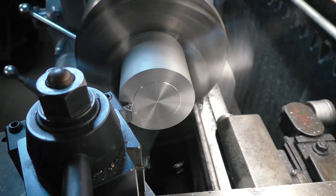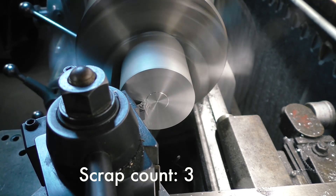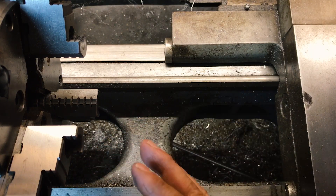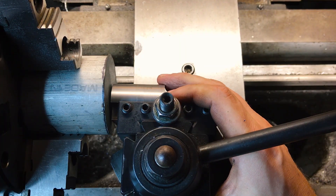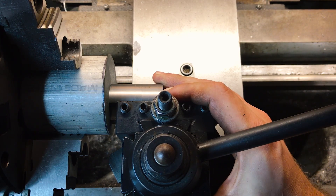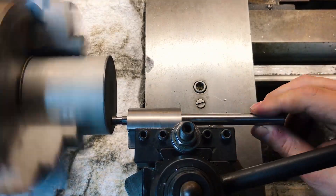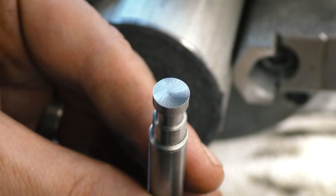I'm taking another piece of scrap cut off aluminum and facing it on the ends. I'm using some spray adhesive to put fine emery cloth on one side and 1000 grit sandpaper on the other, and then back in the chuck it goes. I can then take the little tool post mounted tool we made earlier and get it perfectly aligned with the makeshift disc sander. I probably should have mentioned I don't have a disc sander — that's why I did this. If you or someone you love has a disc or belt sander, I'd probably use that. Now I can use my screw on a stick to run the cross slide back and forth while it's turning to get a nicely, really squarely sanded screw head — first with the emery cloth and then with the fine sandpaper.